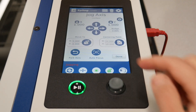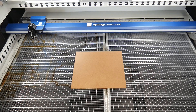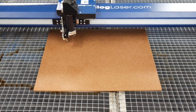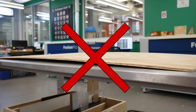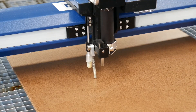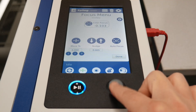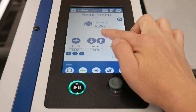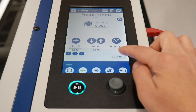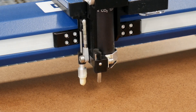press the jog button on the touch screen. Use the joystick to move the gantry over your material. If your material is warped, pick an area that is between the highest and lowest point above the vector table. Note that materials that are severely warped cannot be used. Flip the focus gauge down. Select the focus button on the touch screen. Move the joystick up or down to raise or lower the table appropriately until your material just touches the bottom of the gauge. Press done. Make sure to flip up and secure the focus gauge before running your job.